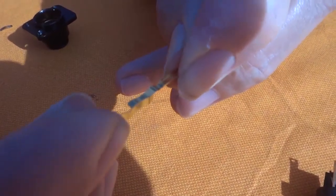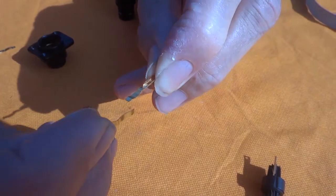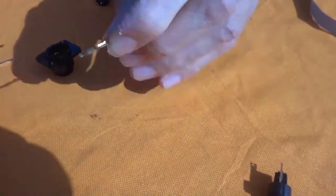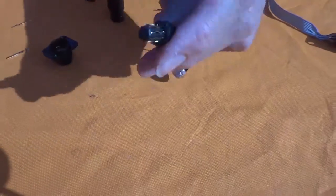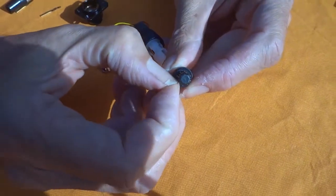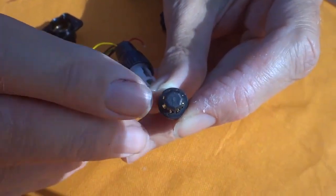This is great, but it has one problem. If this contact stands out a little bit, it bends this contact here. This can happen if the male contact has one standing out like this. Can you see that? Here, this one? The other ones are correct — this one is not quite inserted.